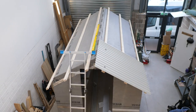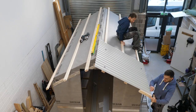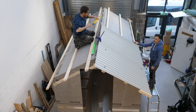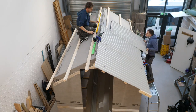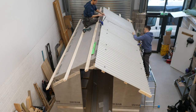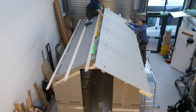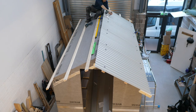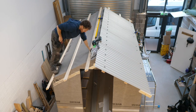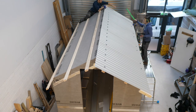We took a lot of time lining up the first piece, and then after that the other pieces went on very quickly. We measured out some chalk lines to keep everything lined up, but because we overlapped two or three ridges on the corrugated steel it kept itself pretty well aligned all the way down the length. We also pre-measured the widths and pre-cut a piece for the end so we didn't have to cut it in place. It was surprisingly difficult for Ben on the roof as there weren't many places to rest — we had to make sure we were resting on the timbers underneath the waterproof membrane, otherwise he'd basically go through into the insulation and interior cladding. The self-tapping screws all went in pretty quick and we managed to get the ridge plate on pretty quick after that.